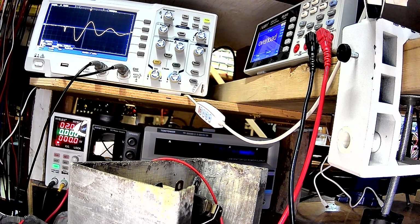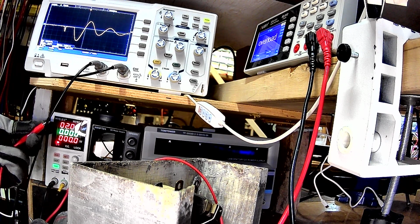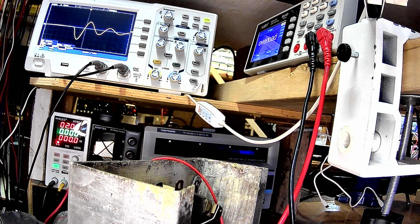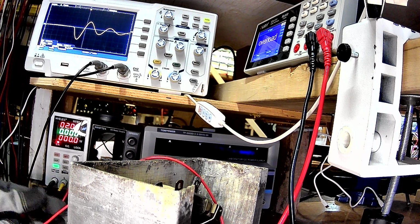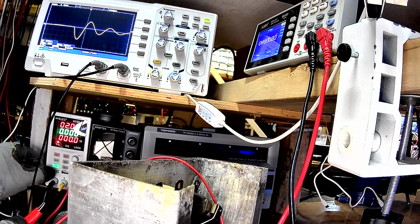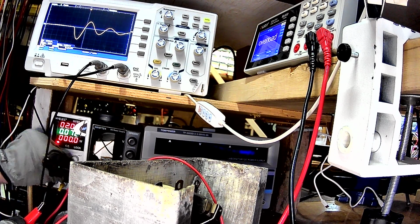Okay, that's like 13 volts, so it'll be about 26 volts peak to peak there. Again, keep in mind I'm only applying 2 volts here. It's all a matter of current. Again, it's consistent. So yeah, it's like 12, 13 volts. I don't know what FileStat predicts because I haven't entered the information into it. But I'm still not in any danger of blowing my oscilloscope out. So let me go ahead and turn the current up to 100 milliamps, and let's see what happens.